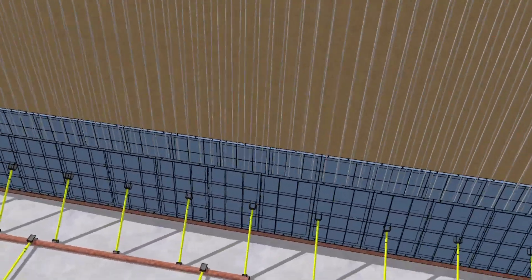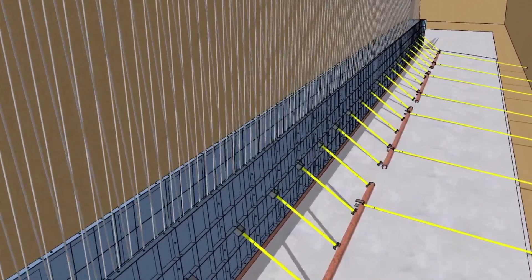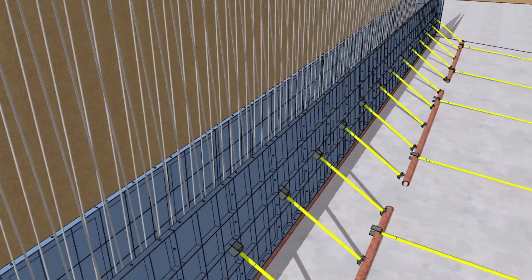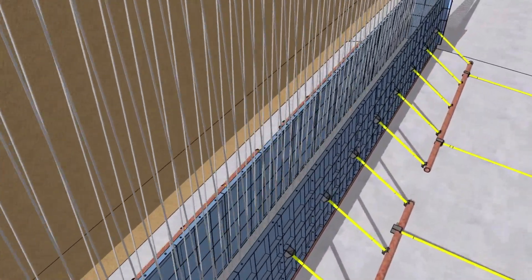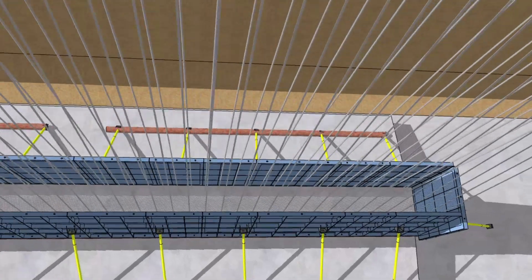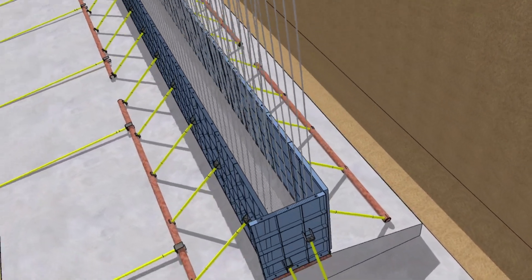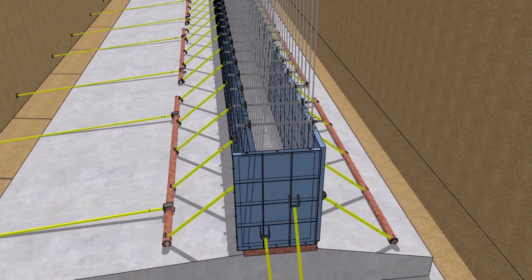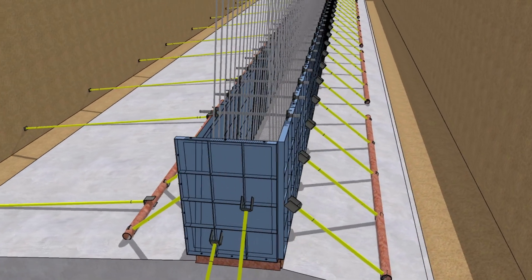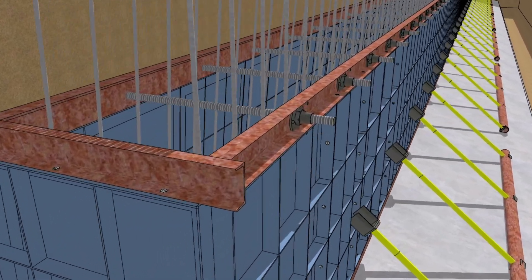For the first lift, all the formwork materials are placed to location as shown in the picture. After that, leveling has been checked with use of a plumb bob for the first layer. Then formwork is tied with tie rods for better strength, and before concreting all the formwork placement was checked by the senior engineer.